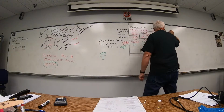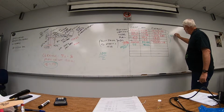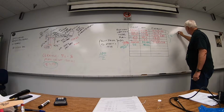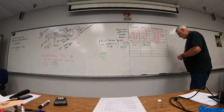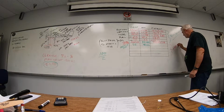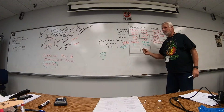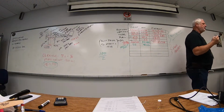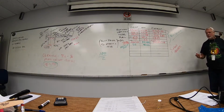So remember, this part up here is just part of your empty weight, and empty weight CG. Now our calculation down here is going to be, for now, our forward adverse check. By the way, we fell in our CG range. There is not a requirement for us to do an adverse weight check on this. I want to show you how to do it because you might need to know it in the future.